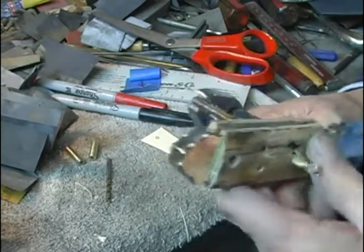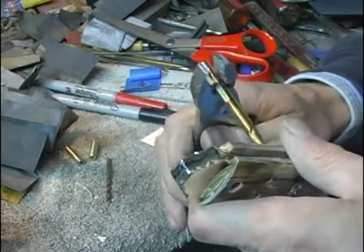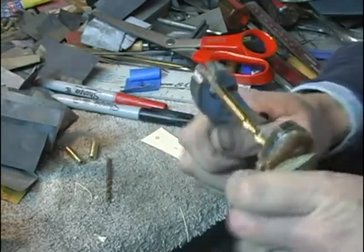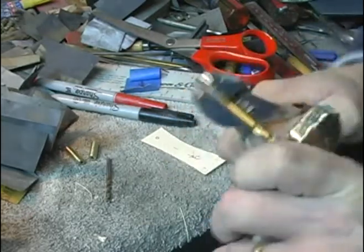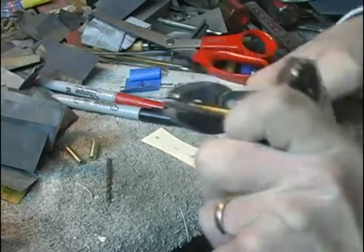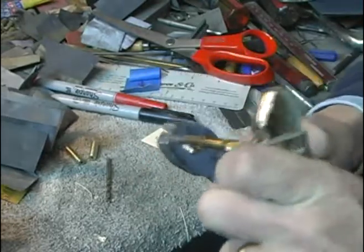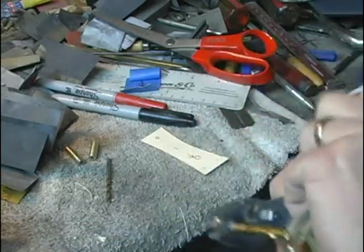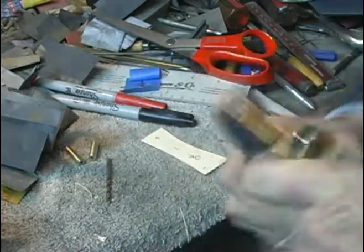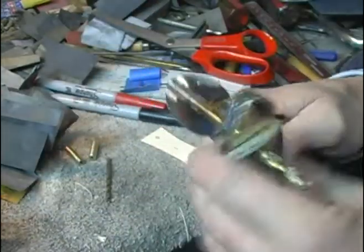And the danger you run into, especially with relatively brittle materials, is if you've got the hole drilled a little bit askew in one side as compared to the other, when you put your pin in, it can torque it and either make it a very difficult fit or, in worst case, even crack your handle material. So it's important to double check, make sure you've got everything perfectly straight and aligned, and running a bit through manually is just a good way to check that.